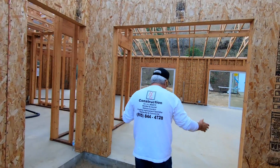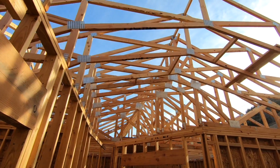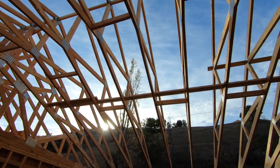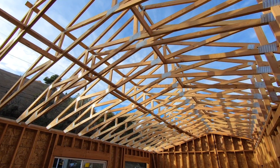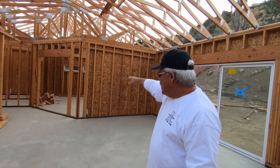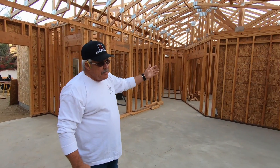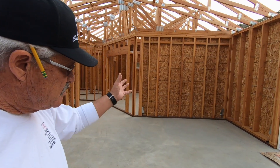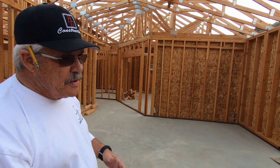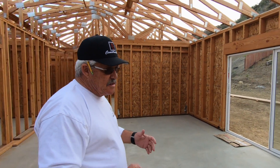This is going to be the owner's front door — a big set of double doors. Then we go into a great room. I sat down with the owner and got our creative juices going and basically asked her what she wanted: a huge great room with an entrance into the whole room, the bedroom over there into her boudoir, the bathrooms, two extra bedrooms. See all the studs? That's a panelized home. Factory-built homes are closed walls — everything's in the wall and it does not breathe. These walls are open so that we can run our plumbing and our electrical, put the insulation in, and then drywall. This house will be able to breathe.